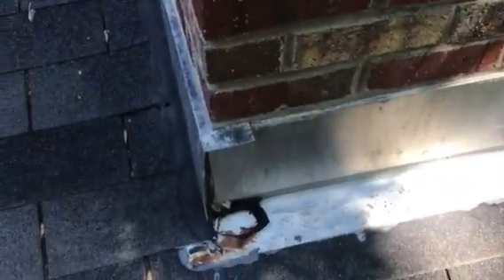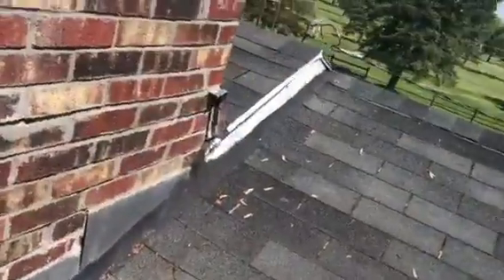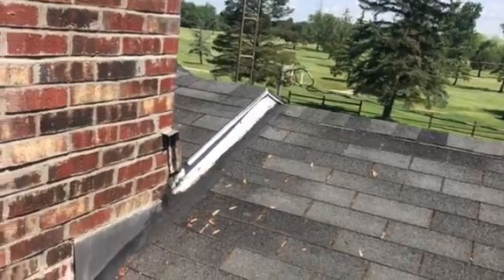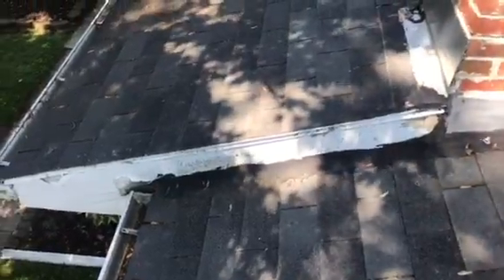It's pretty much completely covered in tar right now. When we come in and do these, we always like to replace the flashing just so we're the ones that did it and we know it's done right. Along here, same thing on this side of the chimney, and then all this flashing above and below it where the white wood hits the roof. That wood looks like it might even be rotted, so we could be looking at having to either wrap it or replace some of that. We'll know that a little more when we get into it.